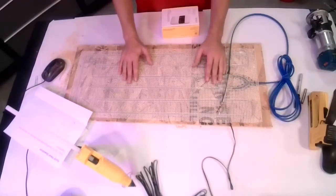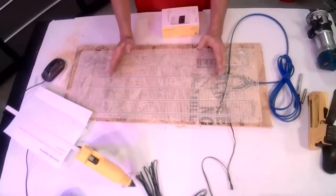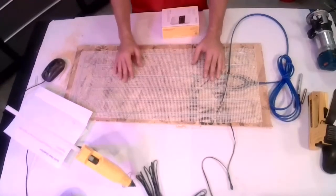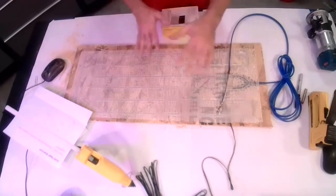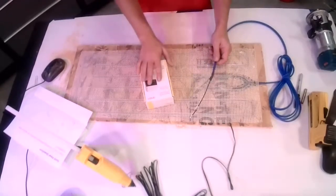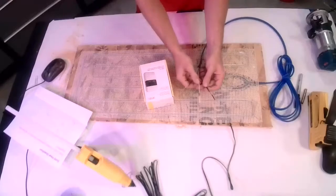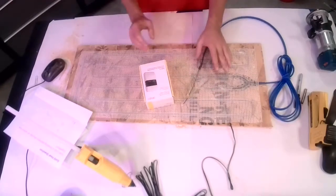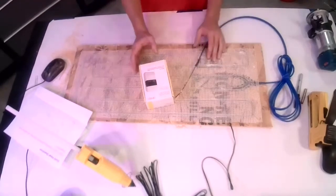In a tiny home, it's probably never going to be more than 2 mats. But depending on your space and the form factor, there are multiple mats that fit together. And in which case, if it's on one controlled zone, you're just wiring everything up in parallel, whites to whites, black to black. Or if it's multiple mats, you may have multiple controllers depending on how it's set up.